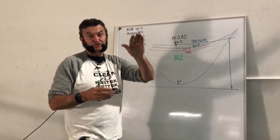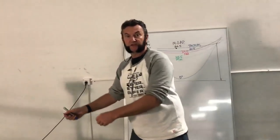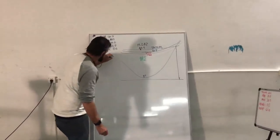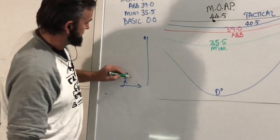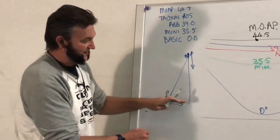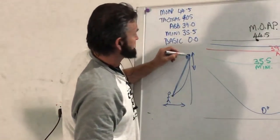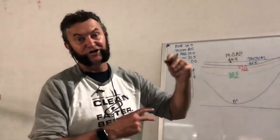And again, what we're trying to do is reduce the amount of flex. Now, when you're doing over three stories, you stop using your arms so much, so you're not trying to push the brush up and down. You start moving on the ground like this. So if you have a look at this, you've got a window up here, you're a little guy down here, moving backwards and forwards, and you've got your pole going up six, seven, eight stories, and you're asking your brush to go up and down like that. So can you see, I'm going to move in the x-axis, and I'm going to ask my brush to move in the y-axis, how important it is that the pole is rigid, otherwise you're going to lose your effort in flex. Right, so we don't want that. We want the pole as rigid as possible the higher you go.